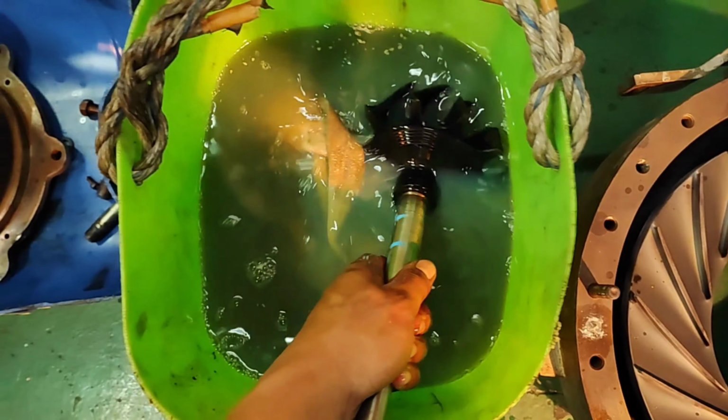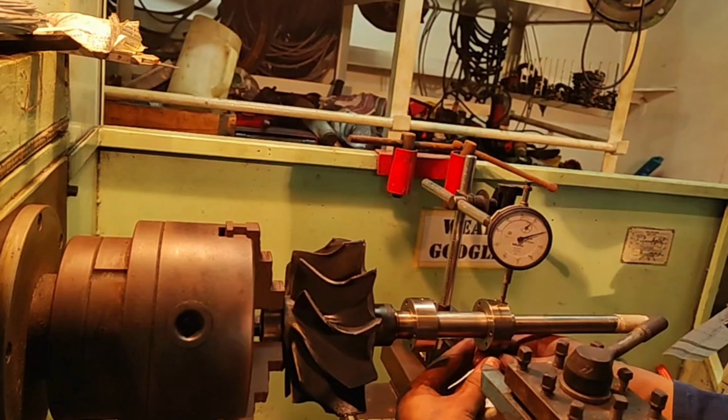Soak the radial turbine blade in warm water in an appropriate container to peel off the scale attached to the surface. Dry sufficiently after washing and coat with rust-preventing oil for anti-rust treatment during the recovery period.